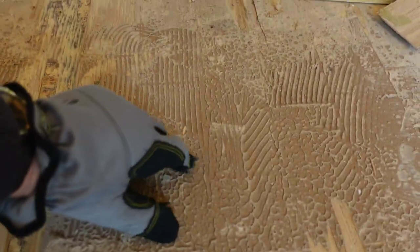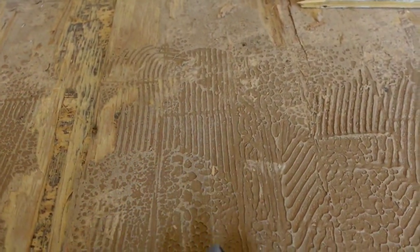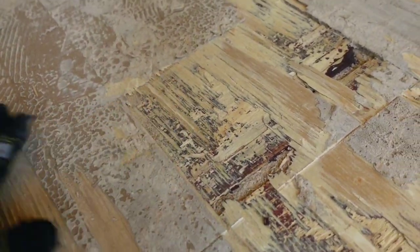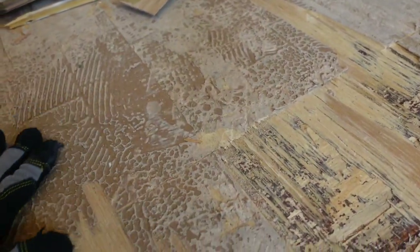Right here, this is just normal - you can see where they did the trowel mark, so that's okay. We just put a little bit of a scrape on it. But you can see as we move over here next to it, these are big giant gouges that have been torn out right here. We'll have to throw the leveler over and let it float over those and that'll make it nice and flat. If you have gouges that go down like half an inch or a quarter of an inch, there's not going to be very much wood left in there when that floor leveler goes on.